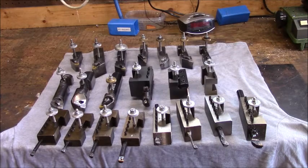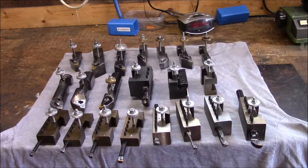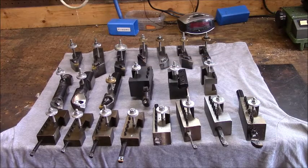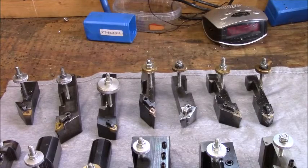There's no real stress to it. Once you drop it onto your quick change block and pull your handle, no matter which type of block, whether it's a wedge or a piston, that's what actually holds your tool to the dovetail. The only purpose of these adjusters on these tools is basically to maintain heights. There are several things I've done along the way to make things better. So what I'm going to do is focus on a row at a time, and we will go from there.